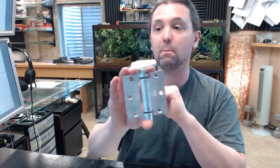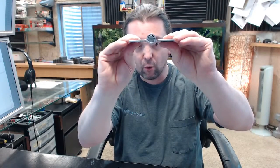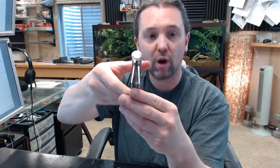There is a link below this video to the template, which shows everything important dimensionally about this hinge, so I won't belabor all those points here, except to say that this is indeed a full mortise hinge, meaning that when the hinge leaves are brought parallel, they are meant to be mortised flush to the edge of the door and frame. This hinge is compatible with the vertical axis of pivoting of typical standard 3.5 inch hinges, so you would be able to mix and match these with regular hinges.